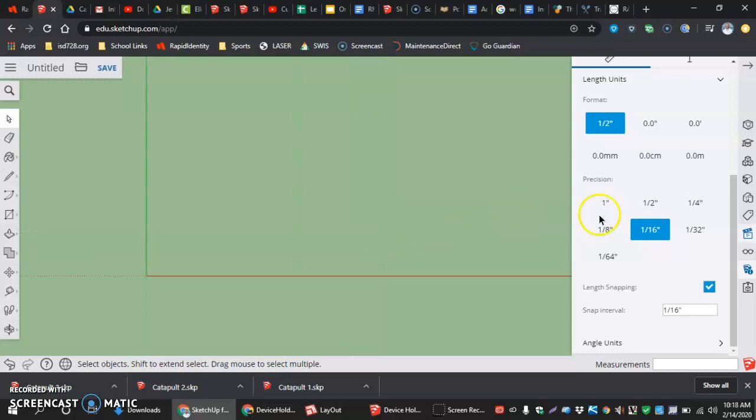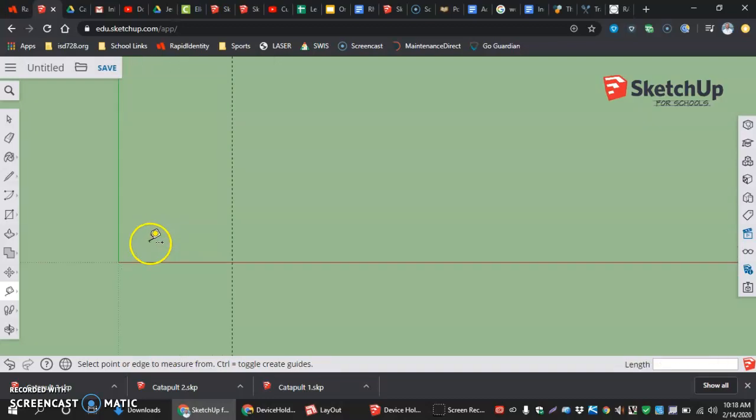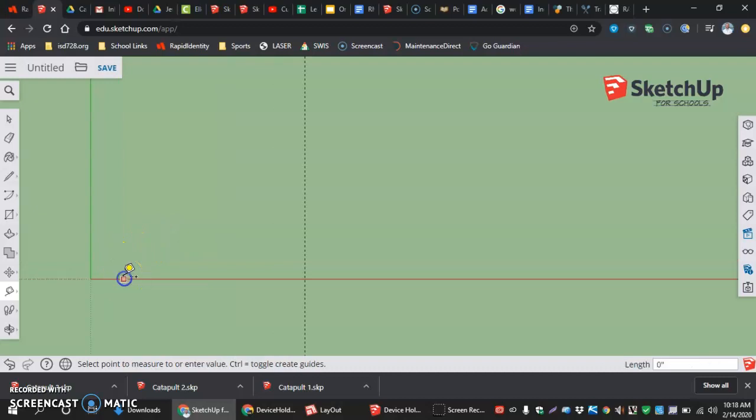So the next thing I'm going to do is put this away, and then use my tape measure tool to make a guideline from the green axis at 11 7/8. Zoom in a little bit because that space didn't look very big, and then from the red axis, 4 7/8. What that does, it gives us 1/8 of an inch around our area for a little room for error, because we have a 5-inch by 12-inch piece that we're cutting our stuff out of on the laser. Now, the next thing I do is save it.